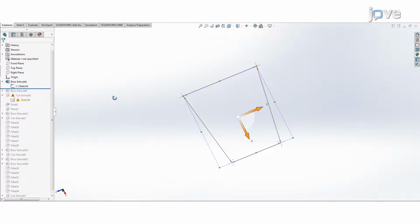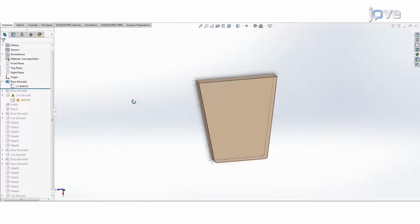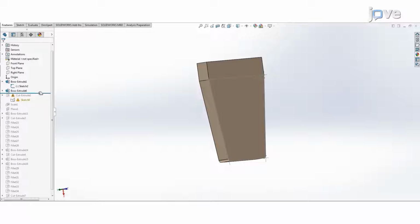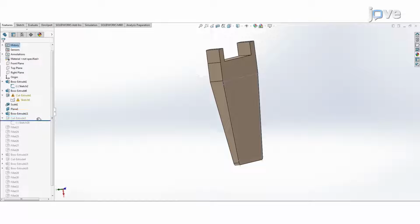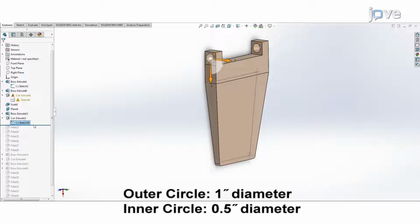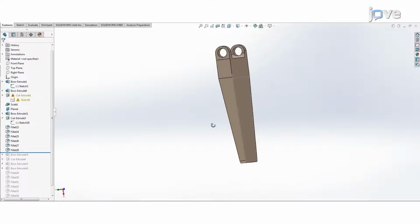In the CAD software, click on Sketch and design the base piece so that it is proportional to the distance between the shoulder joint and the wrist of the specimen sea lion flipper. Add knuckles to the base by clicking on Sketch and drawing 2 circles at both ends of the part. Then click on Boss Extrude to extrude the desired length from the plane of the base piece.